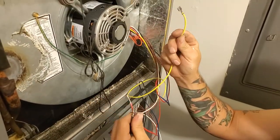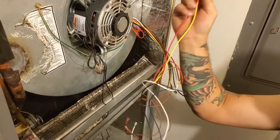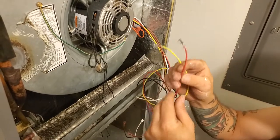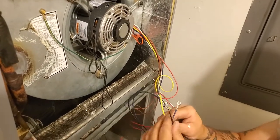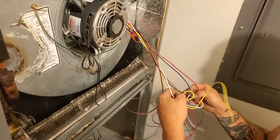This is medium-low for the 1.5 — that's for cooling. Now in heating, if this was a gas furnace, you would put red on your heating side and cooling on your other side. This doesn't have that, so we're going to cap that off. Then you have your medium-high and your high speed for half horsepower.